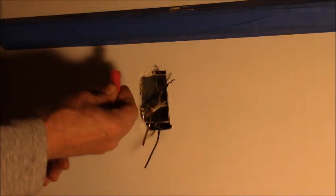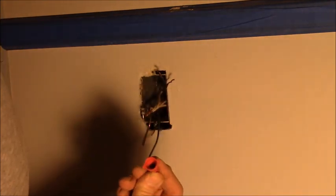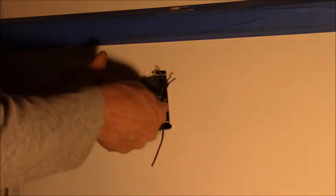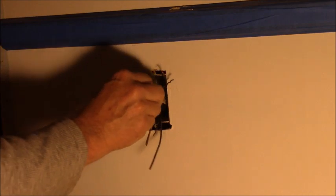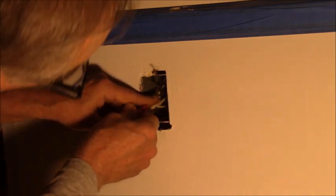And I'm gonna take a new wire nut. This is a Buchanan brand, I believe. Now see how it's got a tapered hole in there with a sharp-edged spring in there. And you'll watch this nut expand as I twist that over the wire. So not only do we have the wires twisted together, now we have the squeezing force of the spring cutting in and producing even another path for the current to flow.